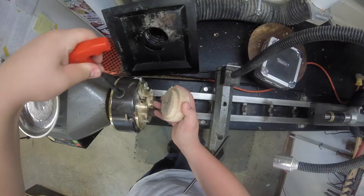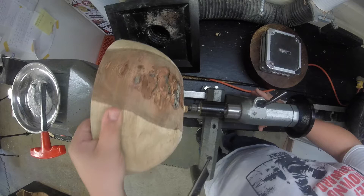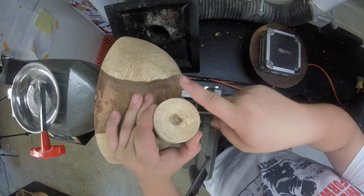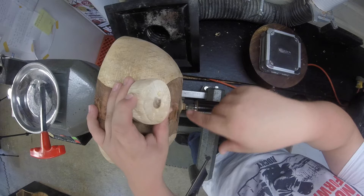Trusty wooden jam chuck never let me down. This is one of those weird trick bowls I did forever ago where I used a faceplate, which makes things difficult right now. But luckily the original center is still on the foot. Here are a couple tips to getting a really good bite on a wooden jam chuck: number one, turn the jam chuck concave — if it's rounded over you're only gonna have one point of contact. If you make it concave and really wide you get a lot of firm contact with the bowl. Number two, crank up the pressure on the tailstock.